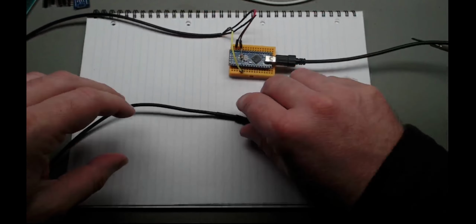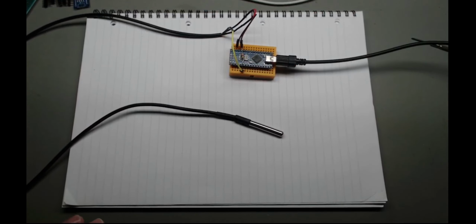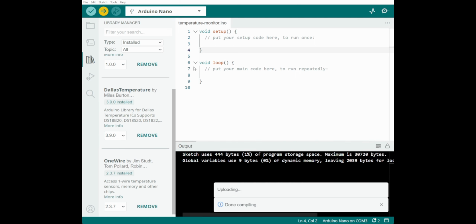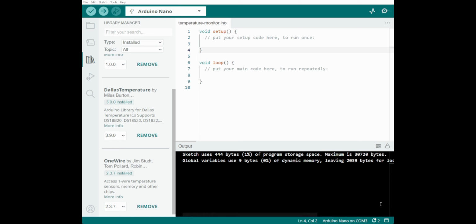Okay, that's all powered up. Let's switch over to the IDE. So let's just first check it works at all, let's upload nothing. Uploading, done. Cool. So we now know that that Arduino is blank and we've got connectivity between the two. So I'm going to be using the Dallas temperature library by Miles Burton, and that needs the OneWire library by,